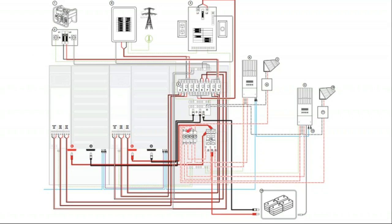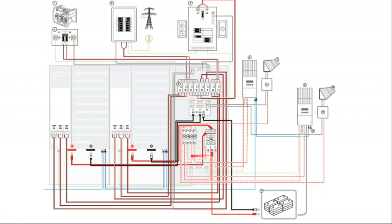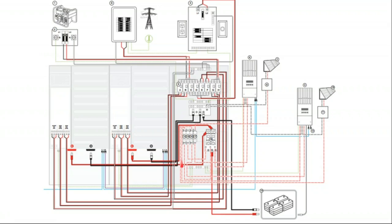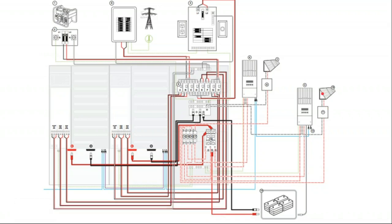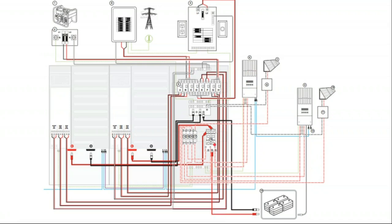Here's another DC bus bar. But what's this for? Well, we trace it back. It traces back to each charge controller. Okay. Now, where's the other bit come from? Well, the other bit comes from the solar array. So this is where the solar array is now being plugged in to the charge controller. And then the charge controller comes out and feeds the DC bus.